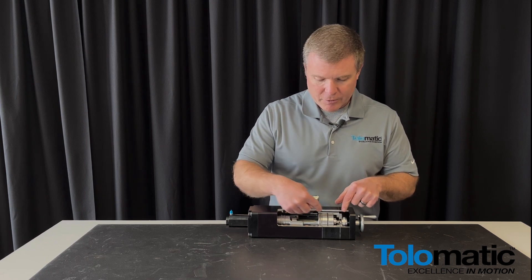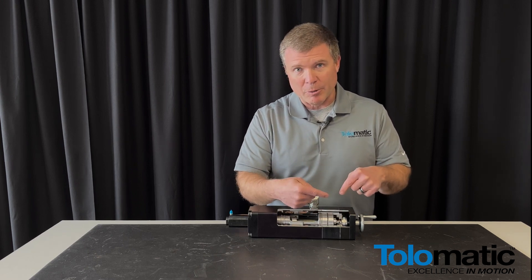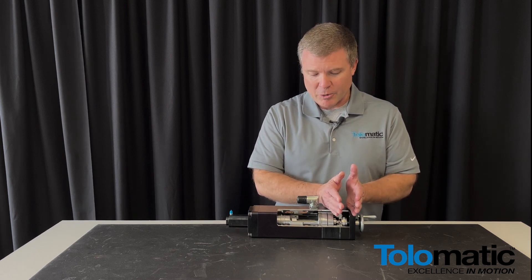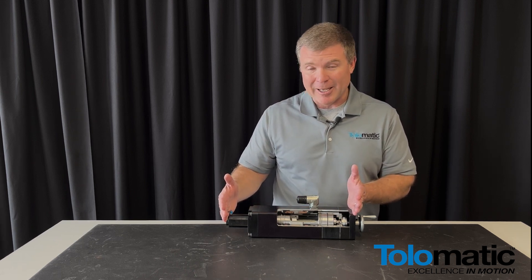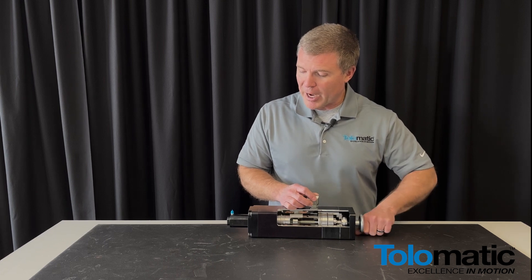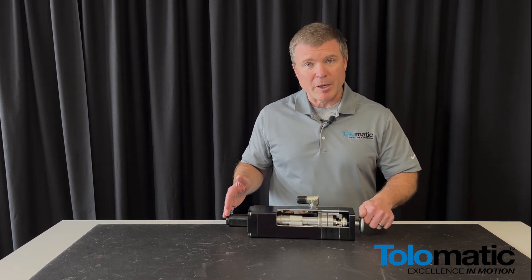On the back side of this, the screw shaft extends through and it's actually connected to an encoder on the back. This encoder is counting revolutions in one direction or the other and gives you a tremendous amount of information about how hard the actuator is working, how fast it's rotating, and exactly what position it's at at any point in time — giving you sort of infinite positioning capability. You can go forward, start here, go backwards, adjust the amount of acceleration, the amount of deceleration. There's a lot of capability here.